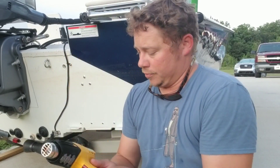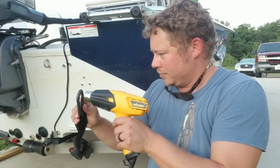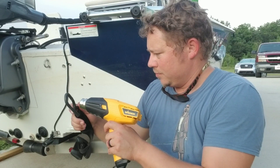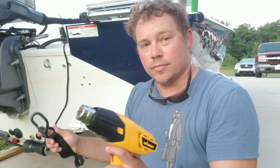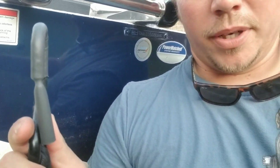Now I'm going to use a heat gun. Get it going, get it nice and hot, shrink it on up. It doesn't take but a second to warm these things up, and it's a lot safer than using something like a cigarette lighter, or propane, or whatever else — this is much safer. As you can see, it's already done a wonderful job of shrinking all of this up. I'm going to cut off this excess, finish shrinking it down, and then we'll do the other side.